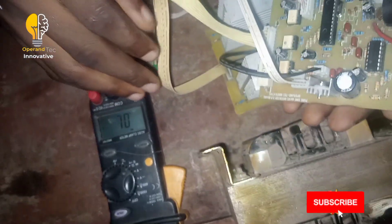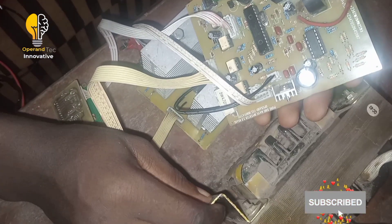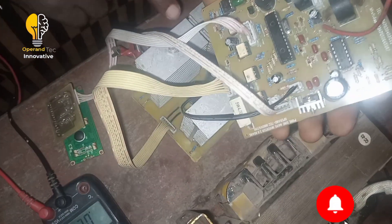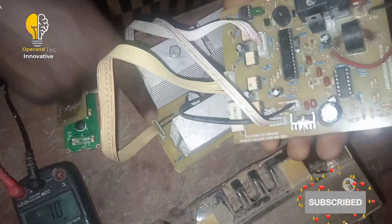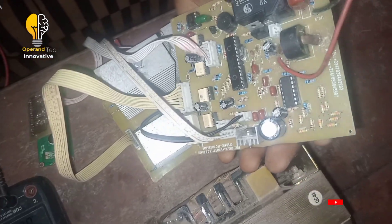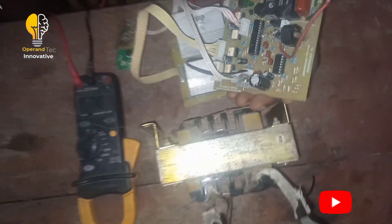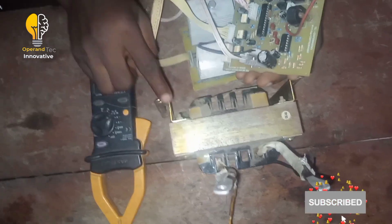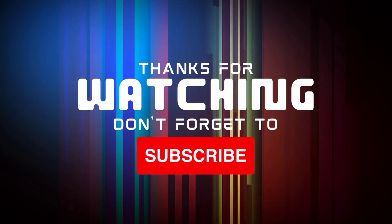In this video I've explained how to select your H-Bridge transformer, how to test your MOSFET board, and how to couple your MOSFET board with your oscillator board. Please make sure the transformer you are getting is H-Bridge configuration — if it is not H-Bridge, it will not work.